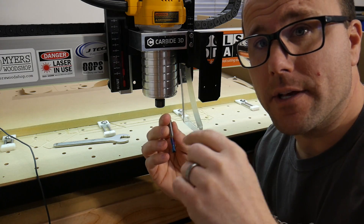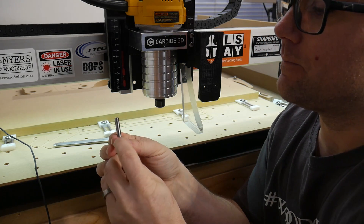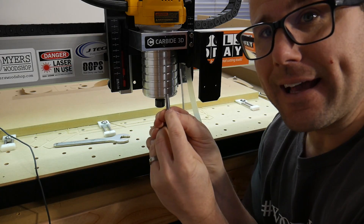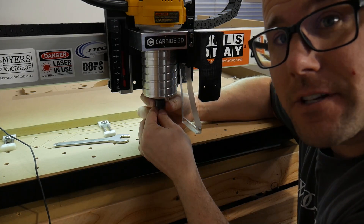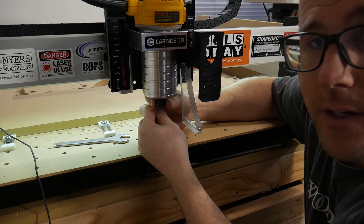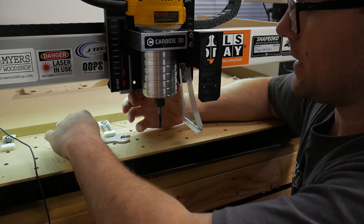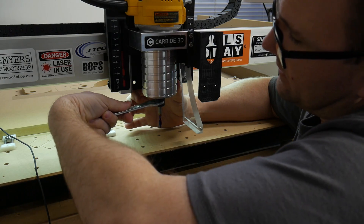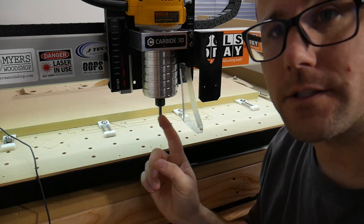Let's get back to switching the bit and cutting out the file. On the Amana tools, if you happen to buy this replacement bit — I'll leave a link in the description below — on the shank it tells you what it is and gives you a little K symbol. At that K symbol is where you place it up into your collet. I really like that feature; that way you're never second-guessing how deep you need to go. You just look at the shaft and it tells you. So I've raised it up to right where that K line meets, hooked it up there, and I'll tighten it down and make sure it's pretty snug so it doesn't spin out. Let's go ahead and zero it.